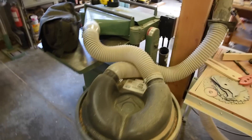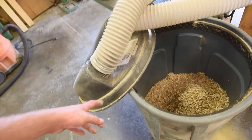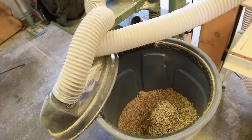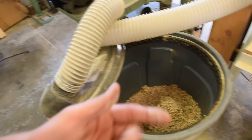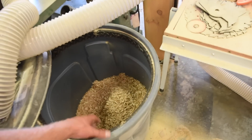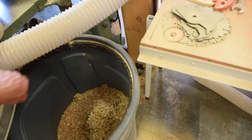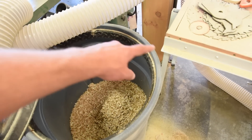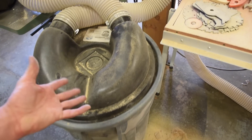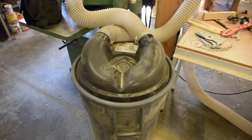So having this that you can just lift off is great — it just sits in here. I modified mine because they say this fits a standard garbage can, but the one I got does not. I couldn't find a garbage can that it fit over top of properly, but it fit perfectly inside one of these big Brutes here. So I just took some industrial rubber matting, screwed it to the inside of the barrel, and caulked it so that when I drop this lid in here it creates a vacuum seal when the dust collection system's on, and it's easy to just pop it off. Works great.